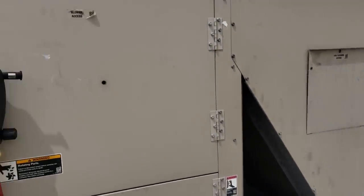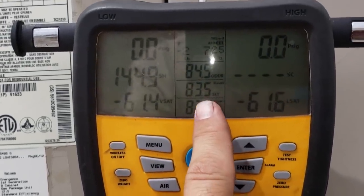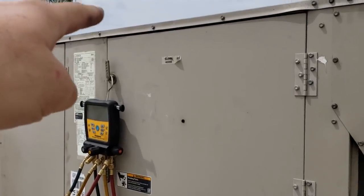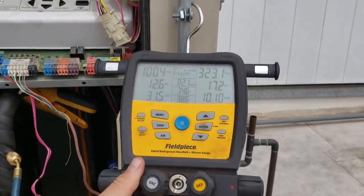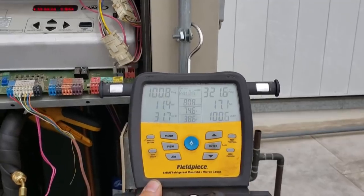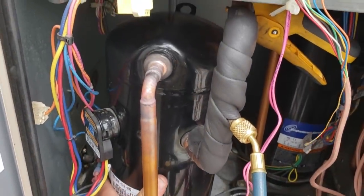We returned to follow up today on this AC. The first thing we're doing is checking the temperature drop across the liquid dryer — I've got temperature clamps on each side and we have pretty much no temperature difference across the liquid dryer. I don't see a restriction in the dryer. Now we're going to apply gauges and I brought the new fan cycle switch. We're looking okay on this circuit — suction pressure is a little on the low side but everything else looks good and superheat is right about where it should be, so I don't want to add more gas. This is the compressor we replaced and it's looking good.